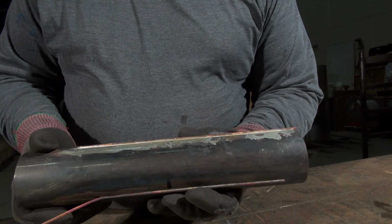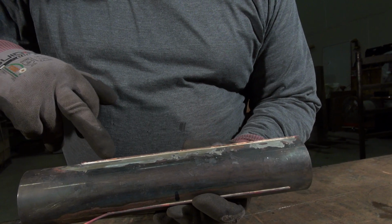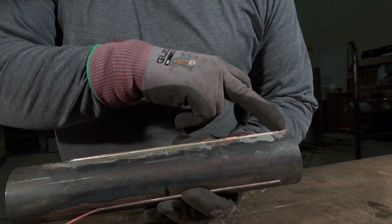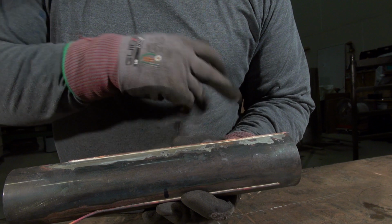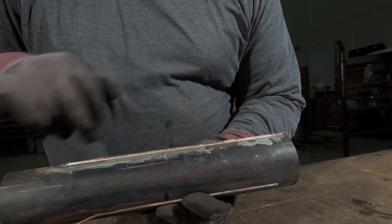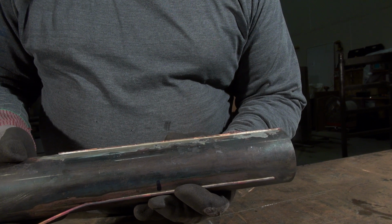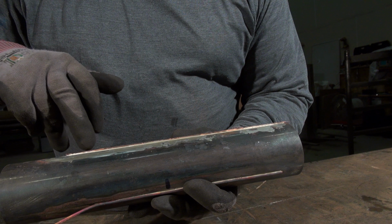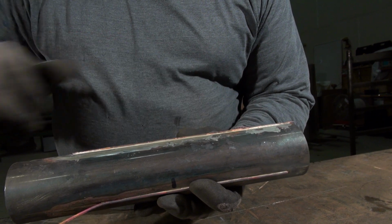From what we can tell here, along this line, along the copper tube, this brightly silvered color is the silver solder material that has crept out from underneath the contact faces, and again showing us that it looks like we have full contact soldering all along this test tube.